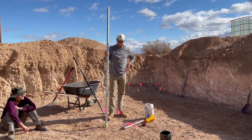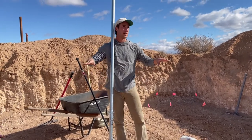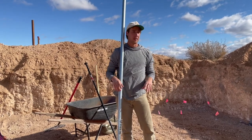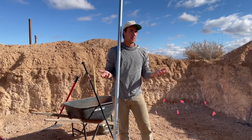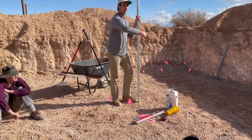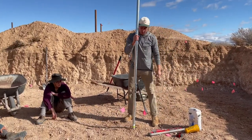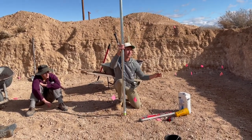You'll see how we fasten the height compasses later on, because remember we have those spring lines — we're springing from that elevation, which is a 12-inch spring line, or 18 inches for the smaller domes. We're going to set all our center compasses now, draw our footprints, and the height compasses will come in later. We'll be laying cylinders, which makes it super easy. If your stake were fastened to the ground, you'd have to do some angling because it's a different length at the base than it is higher up. With this system, with each elevation we just pop it up a little bit and it's that same exact measurement as we go.